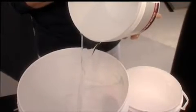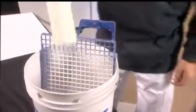Reflessi finishes are carried out over DecorFond, two coats applied using a roller with the product opportunely diluted. The use of a short-haired wool roller is recommended to avoid the formation of the orange peel effect on the substrate.